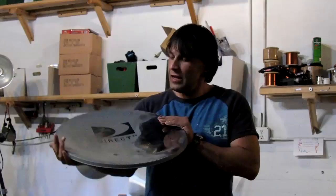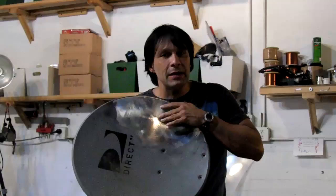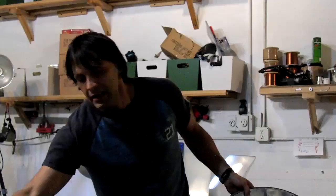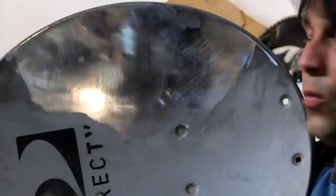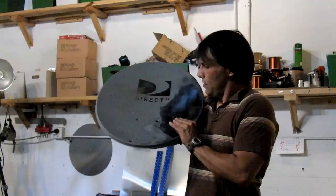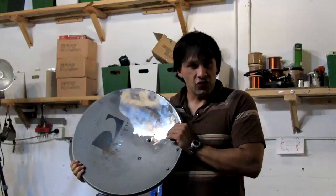The reason I mentioned the black emery cake is for these DirecTV satellite dishes. These can actually be buffed to about a 90 percent mirrored surface. What I did was I took a grinder — this one that belonged to my dad and was handed down to me — to get the paint off. There are probably better ways of getting this baked-on paint off because the grinder actually gouged into the metal surface, creating a lot more work. I still have a lot to do on it, but I was impatient and excited about the results I was getting. You probably wouldn't want to go as aggressively with a grinder as I did.